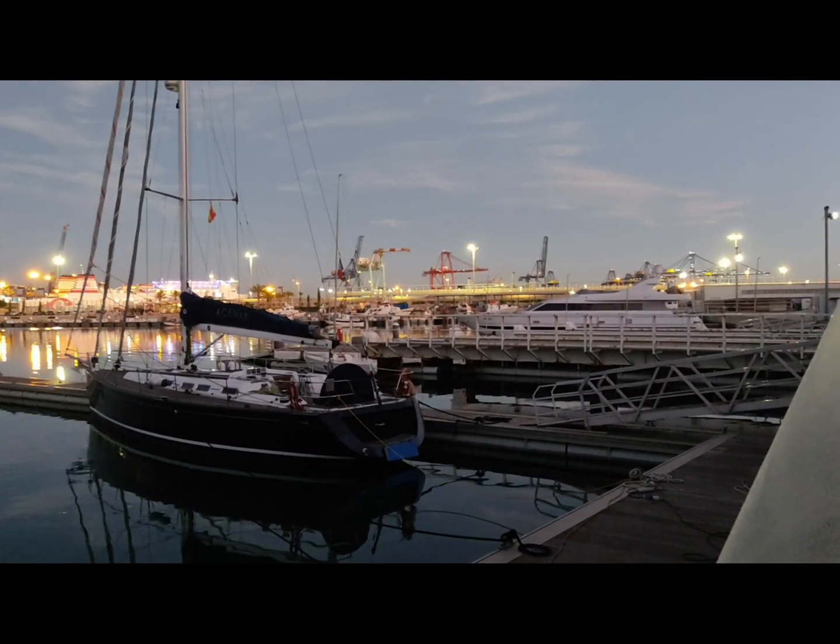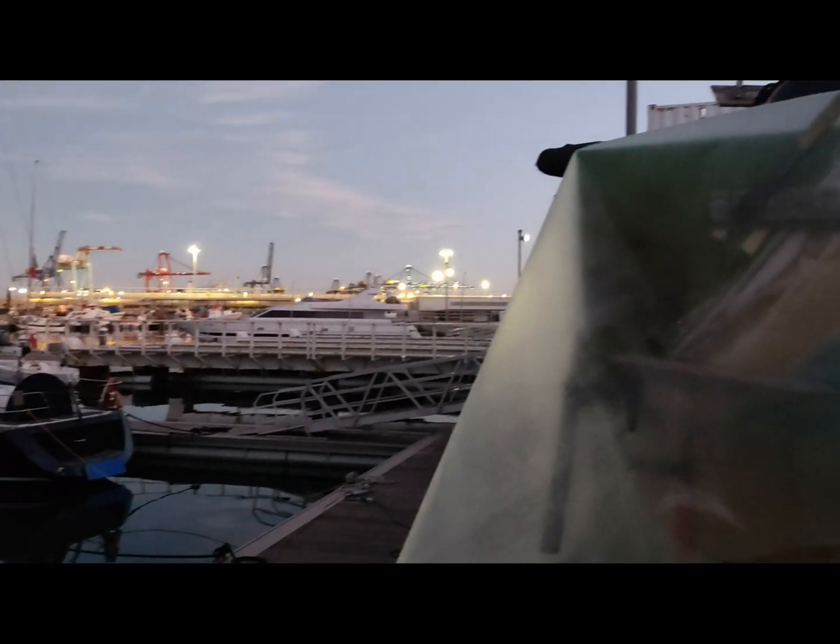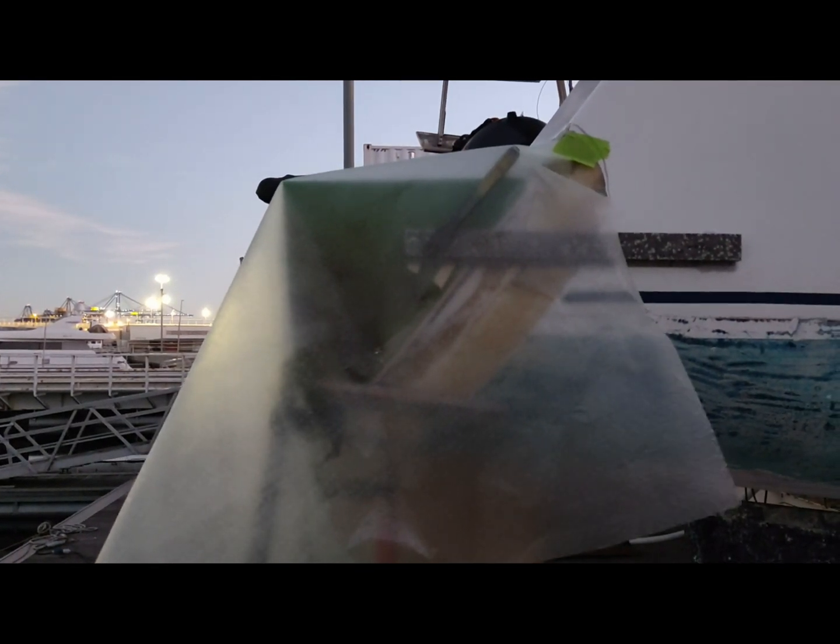While the Spanish party, Shane's been busy trying to extend our transom. It's all foam clamped in place, and then he's actually prepped this under vacuum bag. You can see the fiberglass already on the foam ready to go, so he only has to laminate the outside skin instead of the inside skin as well.